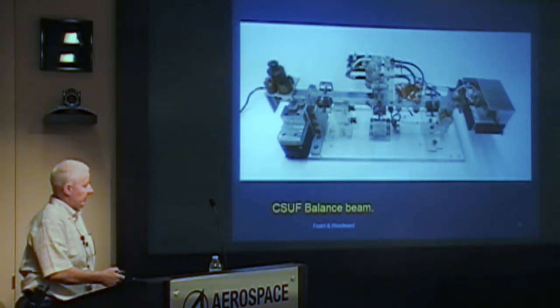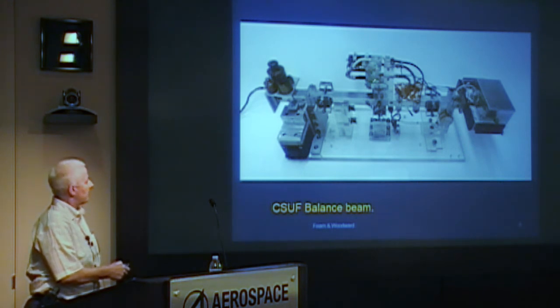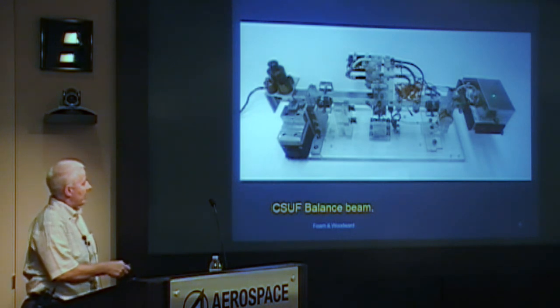This is what it actually looks like. So here you see the central column, and in here are the galinstan contacts, which I'll show on the next slide. They're a bit bigger, you can see them better. Here's our Faraday cage. Over here you see the Philtec sensor. Here's obviously the counterpoise. What you can't see very well is the reflector, because it's hidden behind the armature here. So this thing would swing sort of this way out of the board and swing back the other way.